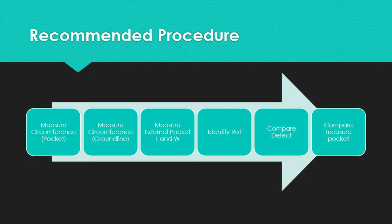The pole inspector should take the following steps as shown on screen. First, take a measurement of the pole's circumference at any external or interior pocket, typically at the ground line. You should also measure the original circumference at the ground line, then remove the shell rot to measure the circumference if the pole has extensive shell rot below or above the ground line, and compare it to the lowest permissible value, which corresponds to the original circumference. The original circumference can be found in the standard mentioned in a previous video.